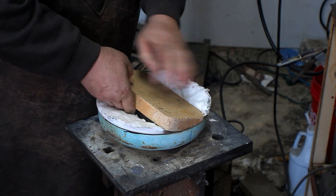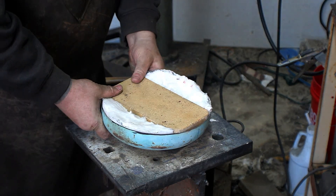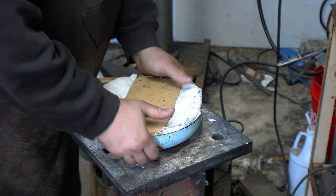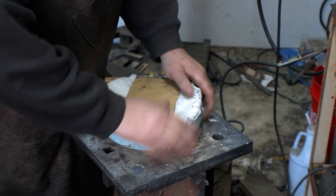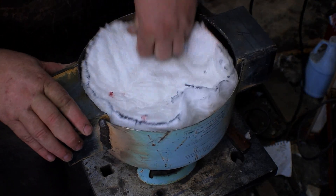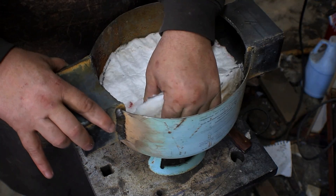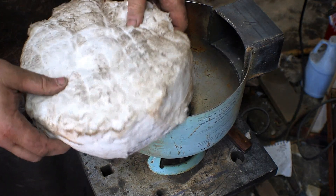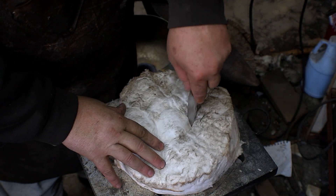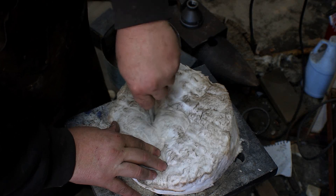You could do the same thing with refractory — if you poured a refractory base on the bottom of this, you'd put your brick in a bag or wrap it in saran wrap, place the brick down in there, let the refractory cure, and you're good to go. We're just going to press the insulation down in there to get an impression of where our flare is, then pull it out — you can see that little impression — and cut it out. You can use a knife or a hole saw; I can't find my 2-inch hole saw, but turn a hole saw backwards and you'll get a nice clean cut.